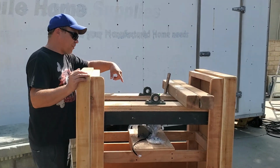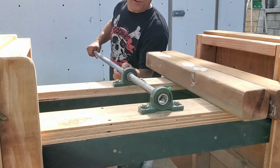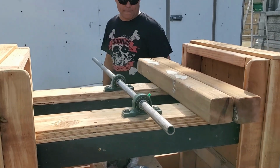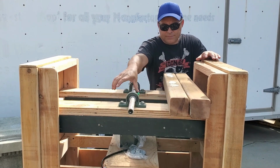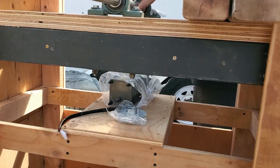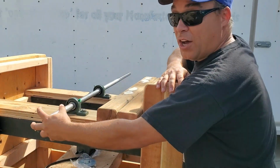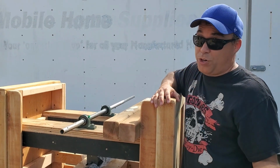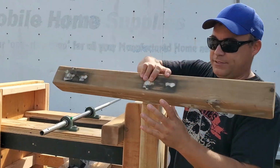And then I'm figuring out the motor portion of it. I had to sand the shaft down a little bit to get it to fit in here, even though it's all 1 inch. But the motor, there'll be a V-belt sprocket that goes on here, and then the motor I have to make a mount for it, mounted right here, but it'll spin here, and then the wheel, I just got a go-kart hub off Amazon, and that'll go on there and attach there. It should work pretty good. Hopefully the motor won't burn out, it'll be strong enough for it. Yeah, hope so. We got kind of a heavy duty one.